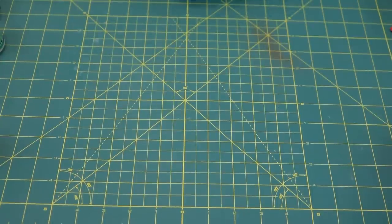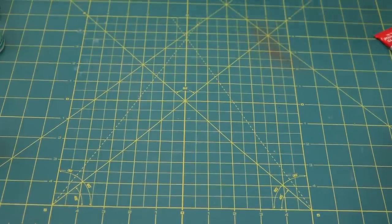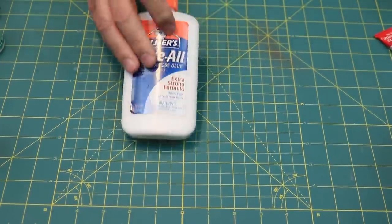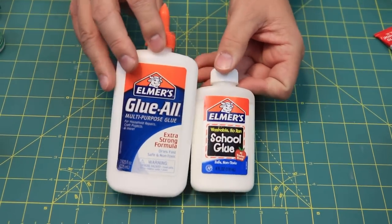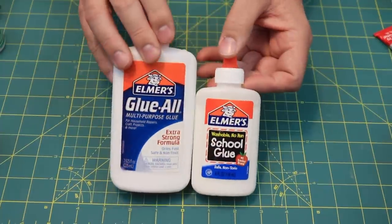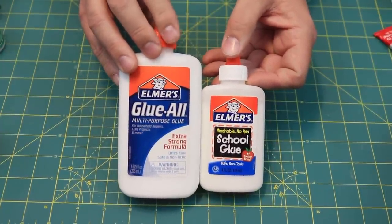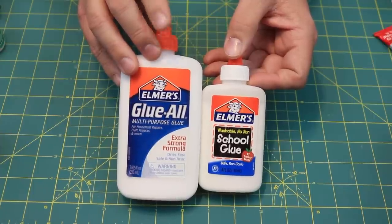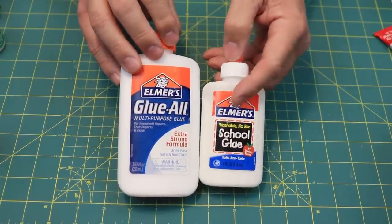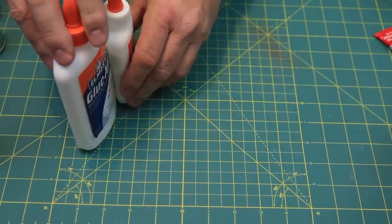Most of the adhesives that I think we probably use on an almost daily basis are evaporative types of adhesives. There are, for example, good old fashioned PVA or white glue. You remember using, you know, school glue back when you were in school. The more grown-up version is Glue All. That's a little stronger, a little less water soluble after it dries. But there are a lot of other kinds of PVAs that we use too,